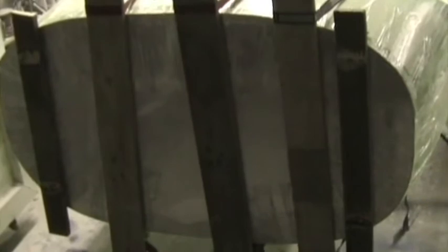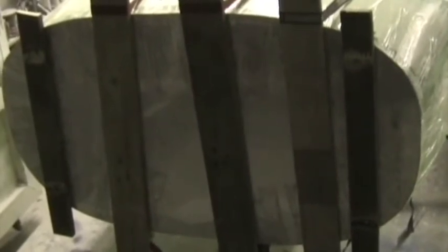Tonight we've bonded the stainless steel firewall in place, thoroughly roughened the rear surface and fiberglass onto which it attaches, applied cotton flocks to both sides in much the same way as when we attached the plywood, and then pulled it down with the four engine mount bolts as well as the other timber that you can see there.